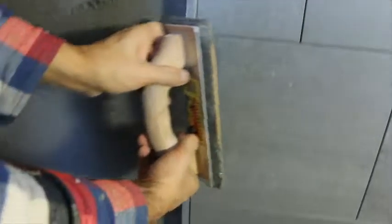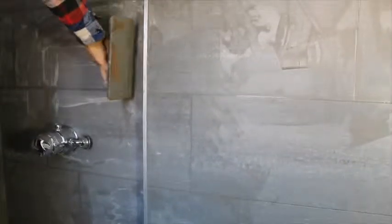Those metal edges — pick those up. I know that I've got a dribble on the face of my grout float and so I've applied bits all down there. I'm going to run down again and pick them up so it's not all over the floor — I was getting too much on the float. Make sure you fill all the gaps between the edges and the tiles. Grout them to full depth.